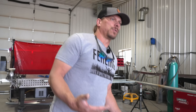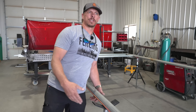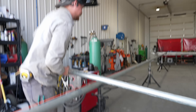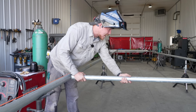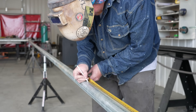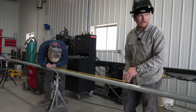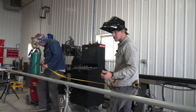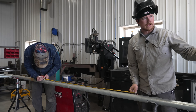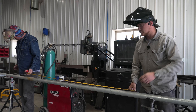We're using this string just to get a visual representation to make sure the gate is super straight. As long as it's not touching anywhere and runs right down the middle, we're good. We're definitely still going to need the straps. We're also marking the center line for where the verticals go in the webbing using soapstone — it's not a perfect mark but it gets us really close. After that we put all the webbing in and square and straighten as needed.